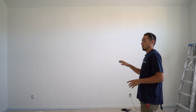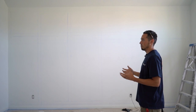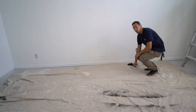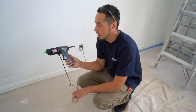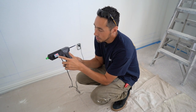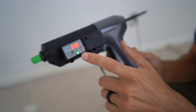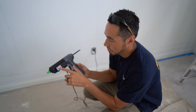Since I use MDF a lot and we're getting away from MDF, I would normally just CA glue it. CA glue works good on wood too, but not as good as MDF, and for something like this I wouldn't even try it. So I'm following Insider Carpentry — he has a 30-minute video on this right here. This is an Infinity Pure adhesive gun. It's heating up right now — you can see it's at 228 degrees Fahrenheit. It does either 248 or 356. It recommends for the 30-second adhesive we're using to go to 248. You can see the temperature just climbing up.